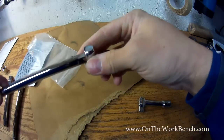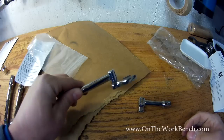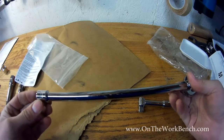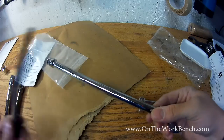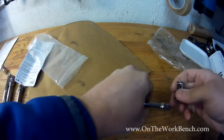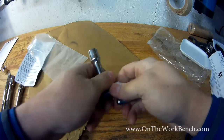Particularly if you're working in some situation where you don't think a universal joint is going to be the right solution, this provides you some extra flexibility — particularly if we're looking at a crow's foot situation, where you might have a crow's foot here. You can go down with your crow's foot, add long chrome extensions, and make this infinitely long, so you can have an infinitely long wrench combined with a crow's foot, just by stacking extensions. You can also put those two together and have an extra offset to further offset your crow's foot.